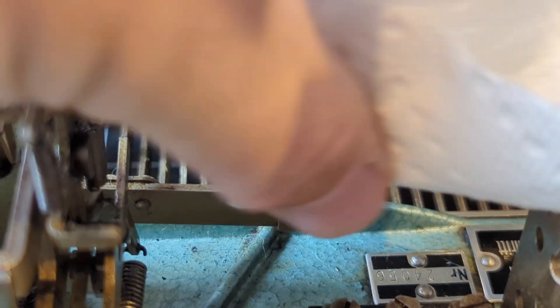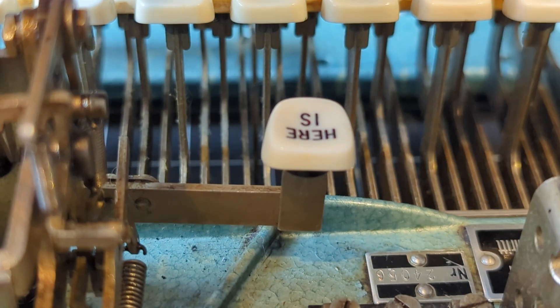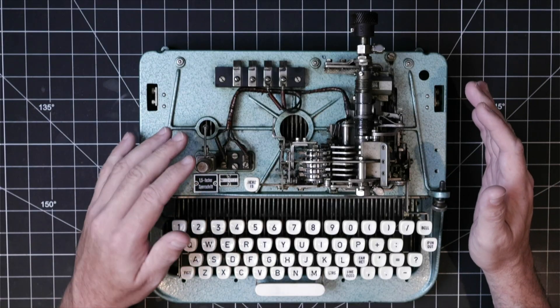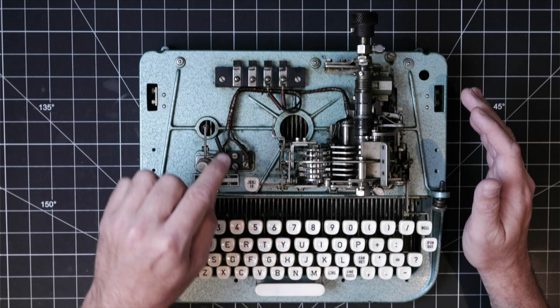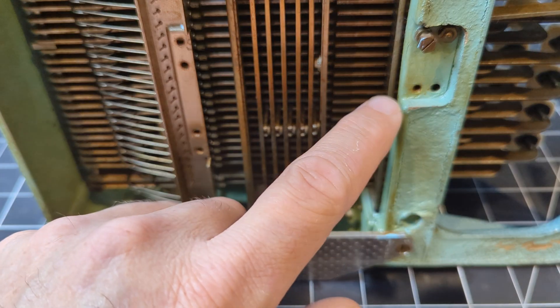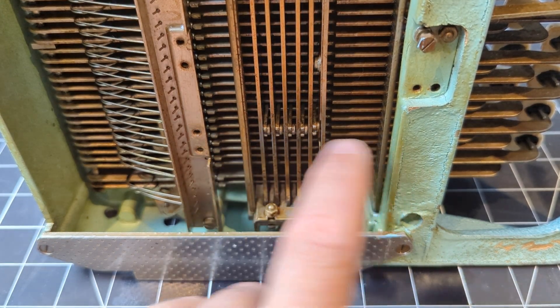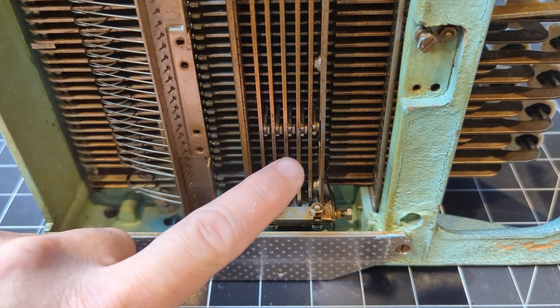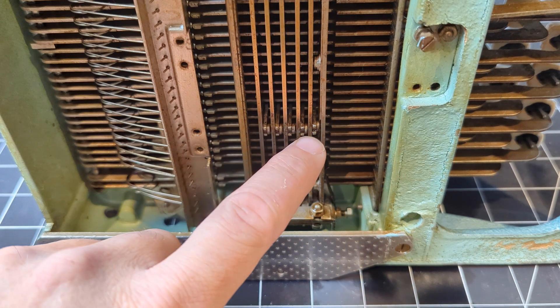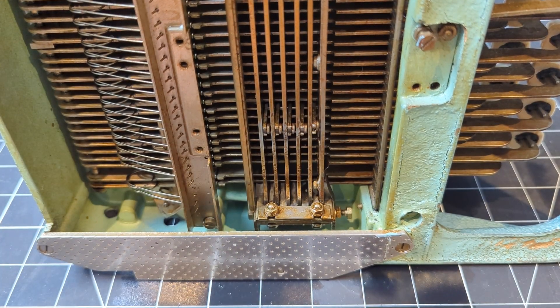While the keycaps aren't easily removable, the large spacing makes it really easy to get them shiny again. This keyboard mechanism is an incredible tribute to ingenuity, because it's basically converting a completely mechanical operation into a digital serial output. With the unit flipped over, we can see on the bottom side that there are levers going horizontally that move depending on which key is being pressed. Then there are crossbars that get shifted up and down depending on the key pressed — an ingenious method of producing a unique pattern depending on which key on the keyboard is pressed.